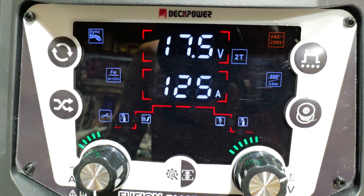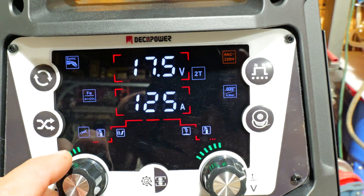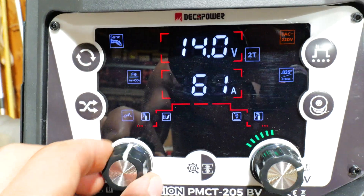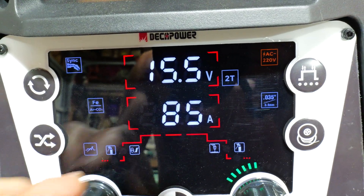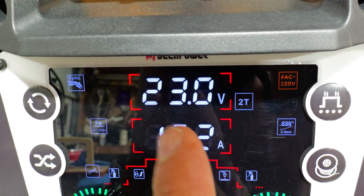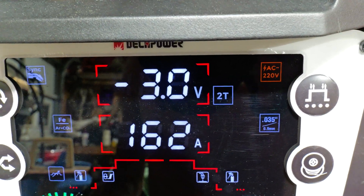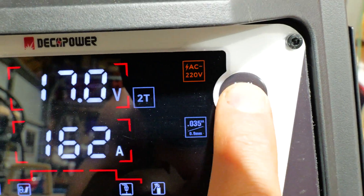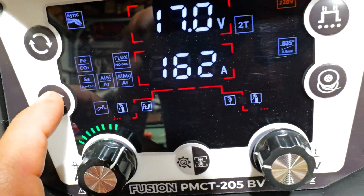Let's take a minute and look at the settings — it's got a ton of settings in here, but don't get intimidated, it's not too bad. It's got everything you need. I just pulled it out of the box and adjusted the amperage. If you want to get started, you can put it on sync — synergic for MIG — and just adjust the amps. It goes up to 200 amps, down to 60 amps on 220. You have standard settings like voltage offset — you can set it to plus or minus to get more or less voltage. You can also adjust wire diameter, 2T versus 4T for pulling the trigger, and there's a spot function.